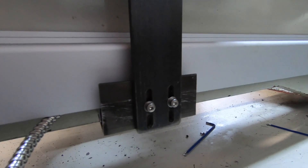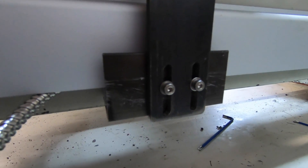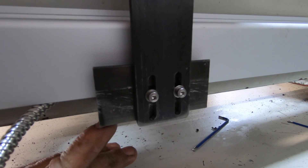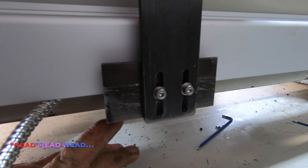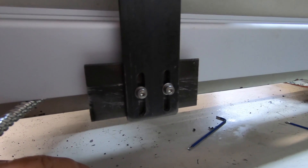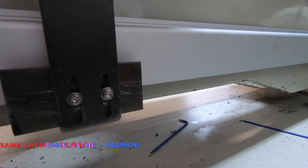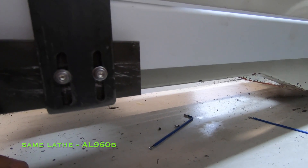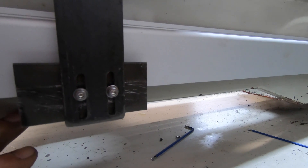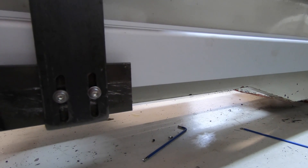So this is what I came up with — a piece of 40mm flat bar down to a piece of angle. I haven't bolted the cover on yet. That piece of angle is slotted underneath and bolts to the bottom of the scale, with adjustment on it. I've got to take it all off and round the corners off, paint everything. I just got Trevor to send me some photos of how his was done at the factory in Sydney at Hare and Forbes — how they've attached theirs. I'll be doing something similar.